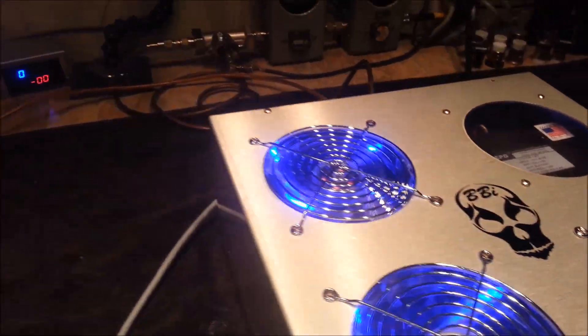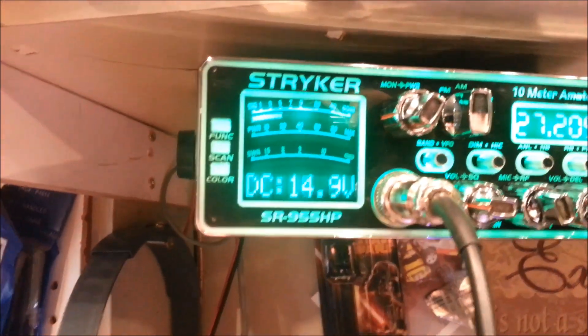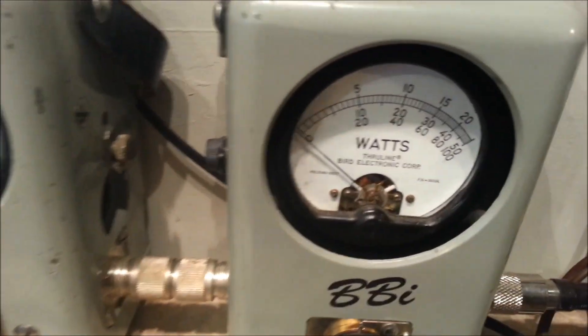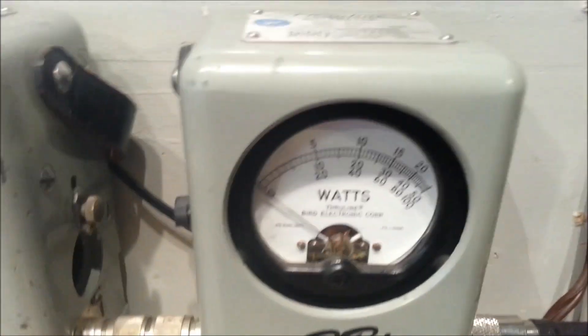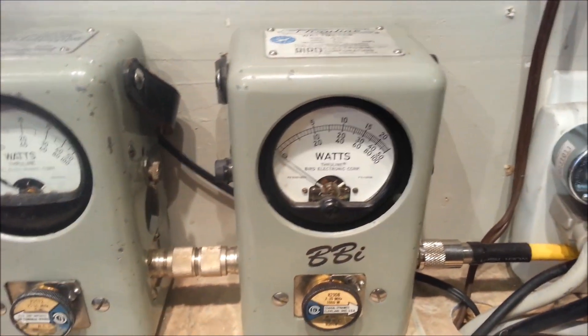What I didn't show you before I switched radios was the input tune. That bottom scale is the SWR — 1.2, 1.3. 1,000-watt scale, 2X scale. That's with the 1-pill driver in line. Jump up to the 6-pill — just straight 6, no driver in line — and we're going to swing BBI about 60, 70 watts into it.